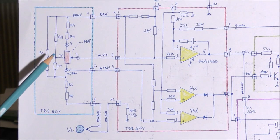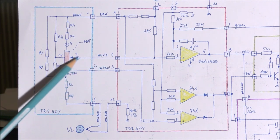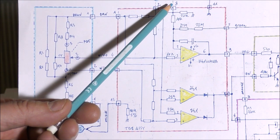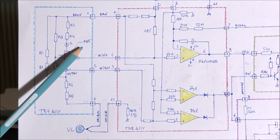We can see that there is a center point on this potentiometer. So this permits to have a function close to a square root function. As this function is on the feedback, there will be a square function regarding the input here, which is proportional to the square root of the static air temperature. Therefore, the angle of the shaft here will be proportional to the static air temperature.